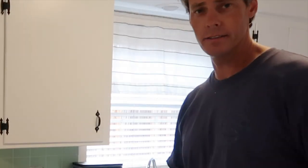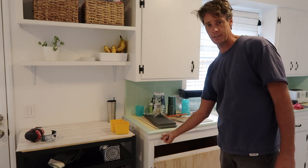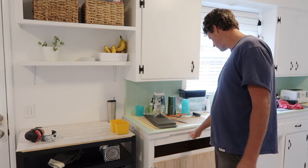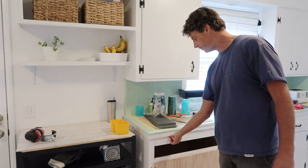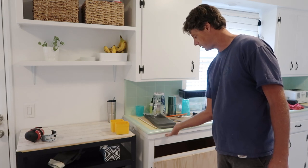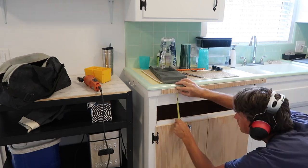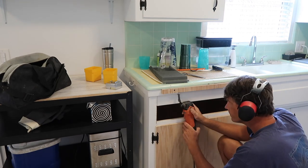In the meantime I can fix the floor nosing. This was a lot that goes underneath the tile — I had to cut it to remove the decrepit non-functioning dishwasher that used to exist in this space. It was a rough cut with a fine saw, so I'm going to clamp a straight edge to it and cut it smooth. I'll make a little piece — we call that a Dutchman — which is just a piece of wood with the same nosing, and I'll get it ready for paint while my drawer box wood is becoming straighter.